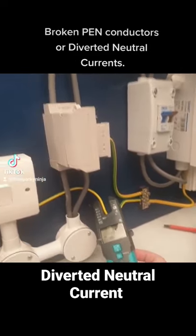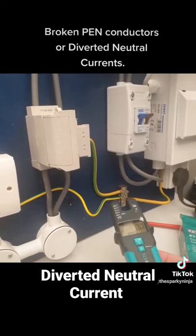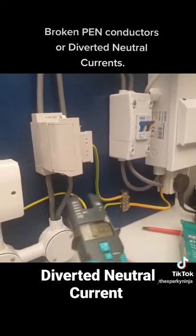You've got to check for any potential parallels going through your protective conductors. Now if we were to remove that, there may be a little spark — we've got to be aware of this. This is why these may need to be insulated, but then that current will then go straight back to the neutral, and 100% will be on line and neutral.